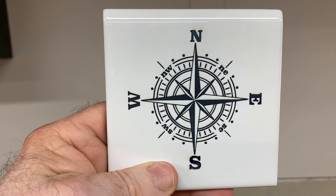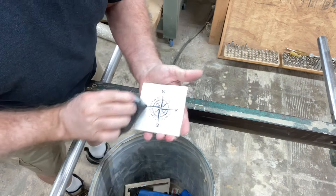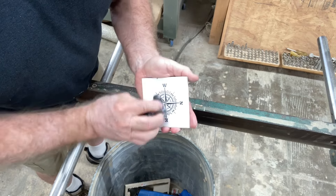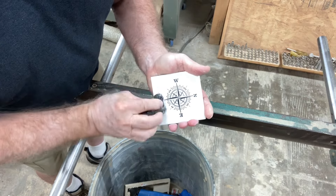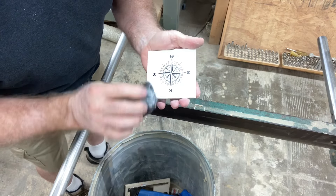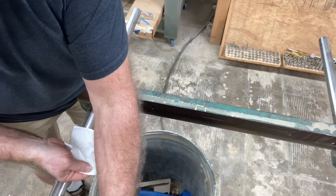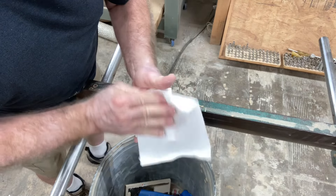Now let's go ahead and do the last step and clean this. I'm taking steel wool and lacquer thinner and literally scrubbing the tile to remove the paint. The white paint looks good but you want it gone — you want the white paint completely removed and you want that natural tile to show through. You're not going to hurt the ceramic tile by scrubbing it with steel wool. The last step is just a clean paper towel with lacquer thinner to wash off the tile and remove any remaining residue from the paint.